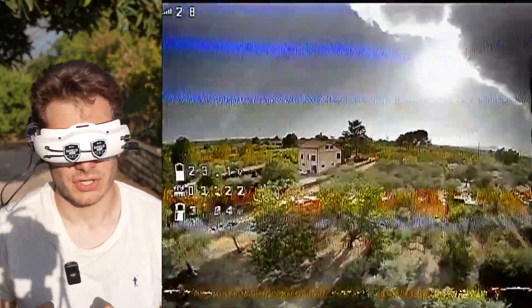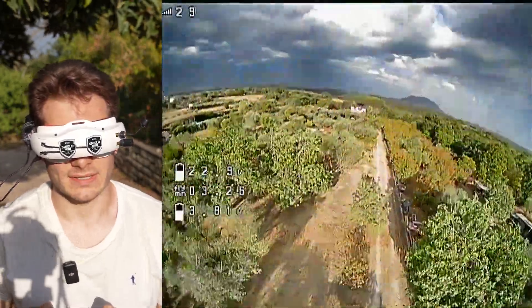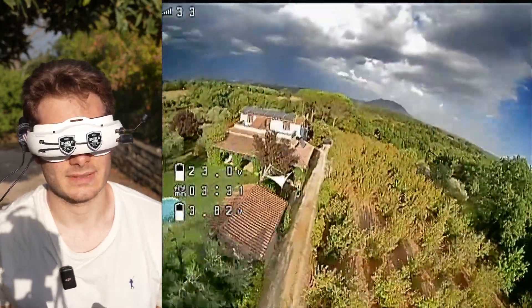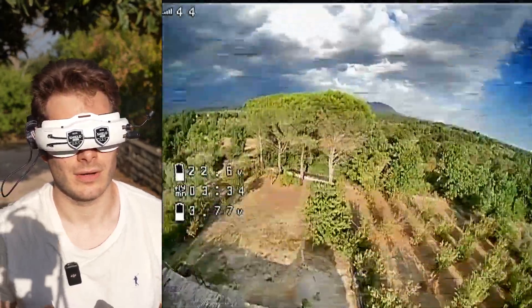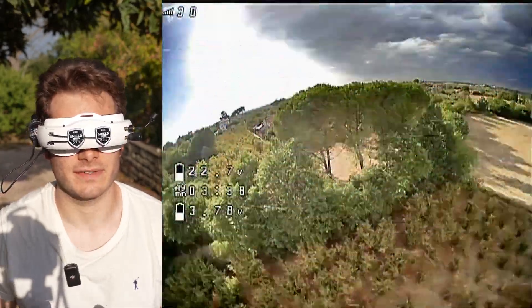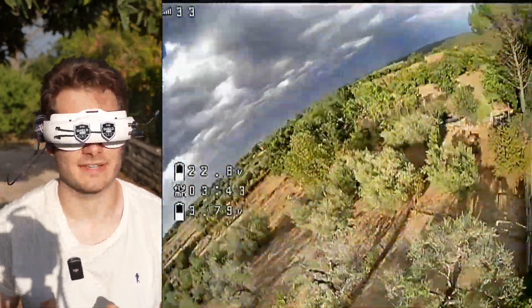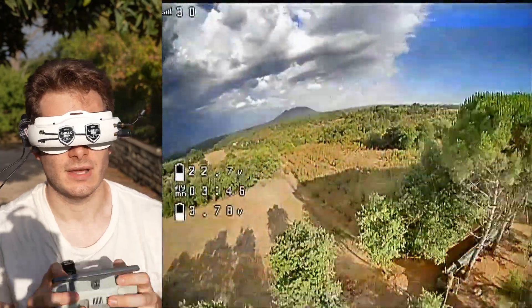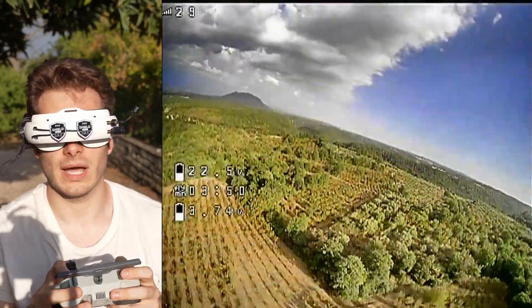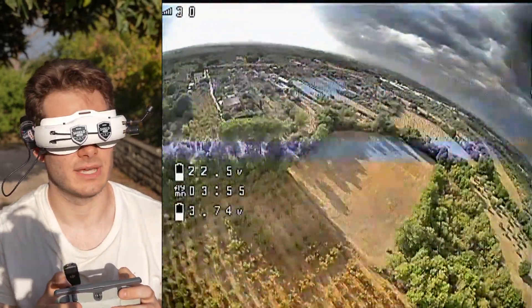This, for a long range drone where you go up to the mountain, is very lightweight and fits very neatly inside the frame — not like the 10,000 milliwatts one. I put extra capacitors on the XT60. There are two capacitors on this drone, but still, when I push the throttle you can see there is some interference from the voltage spike.